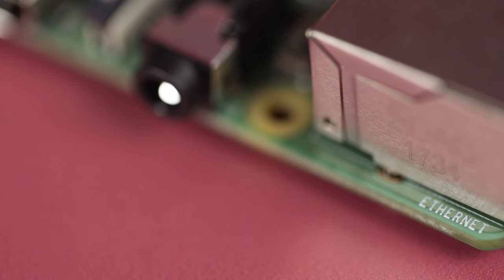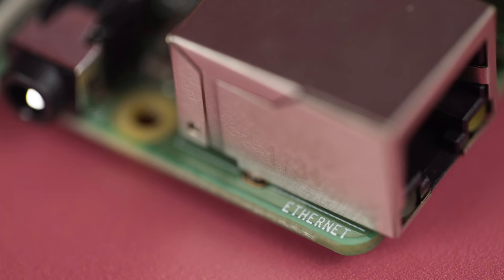That's the wireless end of the connectivity package. What's happened on the wired end? We've changed our Southbridge to another product from Microchip and this has given us much faster Ethernet — we're seeing two to three times the previous performance. We're not using the 'G' word, but it's sort of pseudo-Gigabit Ethernet. The physical level is Gigabit Ethernet, but it's still bridged over USB 2, so you're seeing probably a maximum of 250 to 300 megabits on the line, which is a great bump from what it was before.